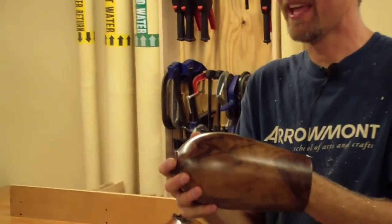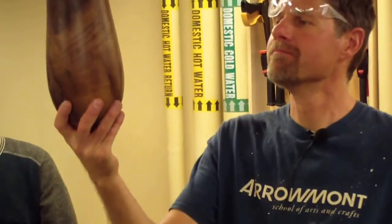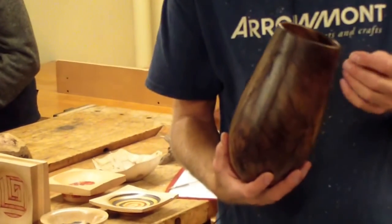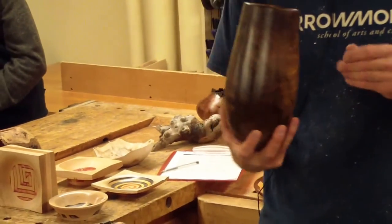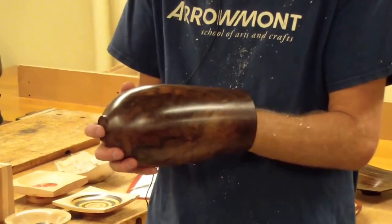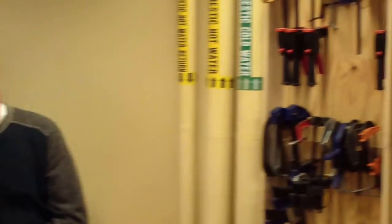And then do you buff it on the lathe? No, I just buff it with 4-0 steel wool, and then I just hold it on a cloth buffing wheel with no compounding. What's the finish? It's a mix of what? Tell us again the finish you were using. Seal-a-Cell, red label. How do you do the inside? Just get your hand in there and just work on it. If you guys haven't put your hand in this guy's vessel, you have to. This is nice in there. Beautiful. Great piece of wood. Well, saturated thoroughly. Good shape. Until it doesn't soak in anymore. About 20, 30 minutes, and then I'll wipe it. How about this one? Wiping it for a couple hours.